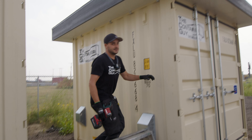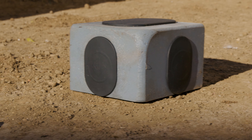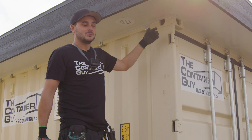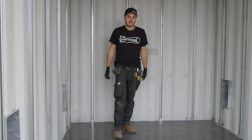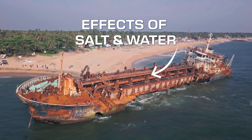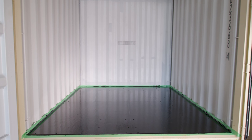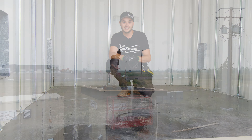One thing we could have done is put those lift point rubber plugs in to stop birds, rodents, and things from growing in there — but with no room left I might have to fill it with foam sealant and put a metal plate across. Longevity is super important on this specific mod because it's going to a potash mine — on the surface there's a ton of salt, and when that salt mixes with oxygen and rain it destroys metal. So we epoxy coated the floor to protect the interior from potential water intrusion or humidity that could eat away and ruin the service life of this structure.